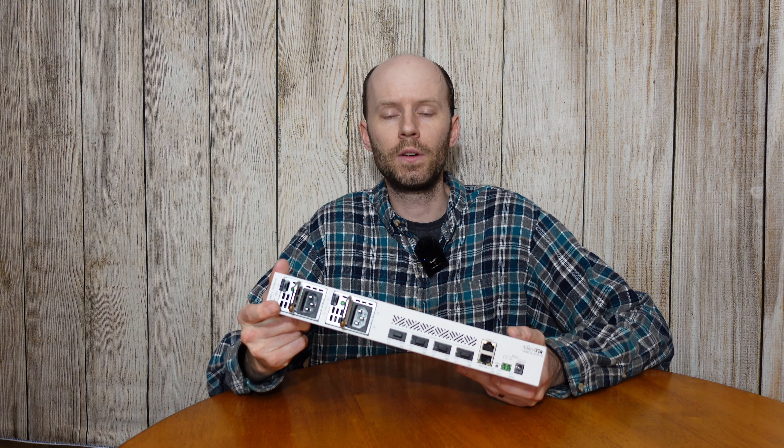The Mikrotik CRS504-4XQ-IN 100 gigabit switch — as cool as this product is, I think 100 gigabit bandwidth is a little bit more than I need in my home lab. I do have 10 gigs set up to some of my devices and that's good enough for my use. Where I really see this switch being used is if you have multiple high-speed switches — maybe multiple 10 or 40 gig switches — and you need a common point to connect them all together. Or if you have a rack trying to roll out 25 gig to all of your servers, you could use the 1-to-4 breakout cables giving you a cheap 25 gig 16-port switch. I am going to work on tuning iPerf3 a little bit — I do believe it is CPU-bound based on what we saw on HTOP. That server is running an E5-2699v3 CPU. If there's anything else you'd like to see me test or demo with this switch, feel free to leave a comment below. Hit that like button before you go, and thanks for watching.